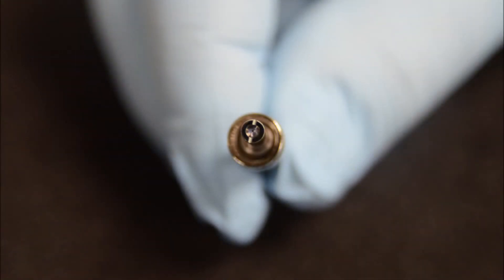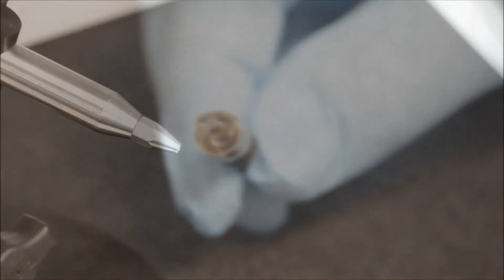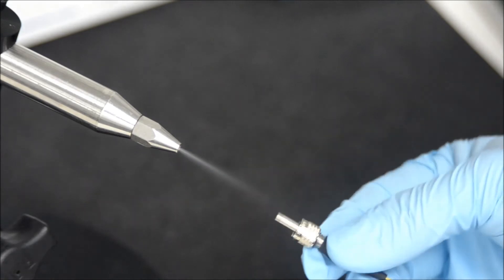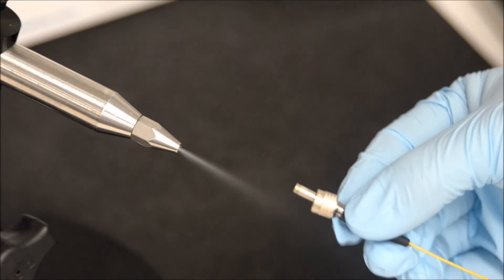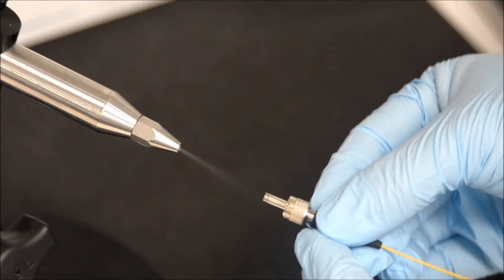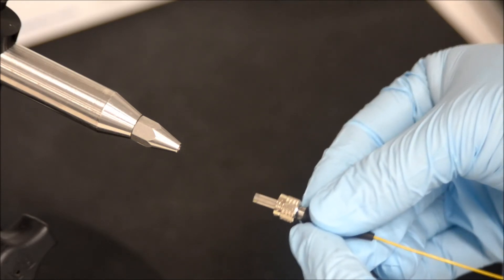We will demonstrate the basic cleaning technique on a high-power air gap connector. This high-power connector has a free-standing fiber in the center, so wiping any contamination off is not possible. This is an example of an intricate item that cannot be cleaned by using everyday methods. Here is a close-up of the nozzle. Push the snow pedal to turn the snow on, and once the snow flow has stabilized, introduce the connector approximately 1 to 2 inches from the nozzle. Feel free to translate the item in a plane, as well as tilting the item. The cleaning process is quick. We have switched over to the propellant-only side now and are keeping the connector in the clean and dry environment. We will show that again in real-time shortly.